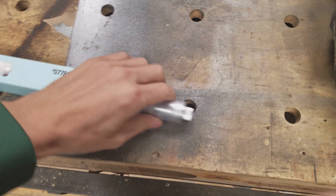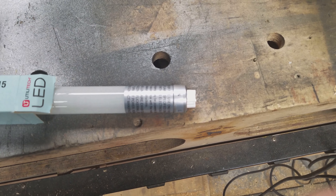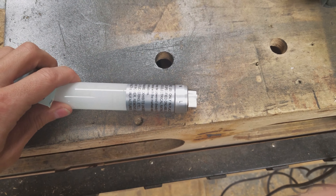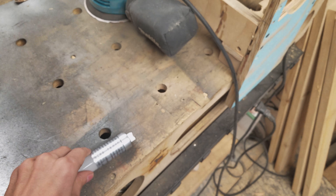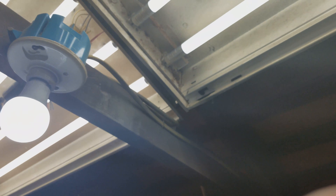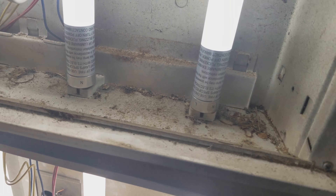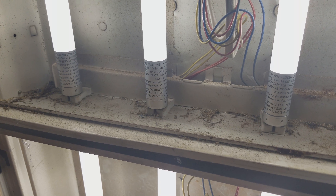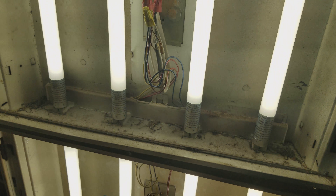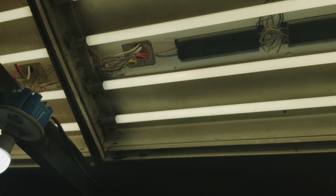When you pull the tube out on one end, you'll see an N and an L. Make sure that side is your neutral and your load or line — that's going to be the side that ties in to where the electric is. You can see they're all on that side where you're actually tying them in. Just make sure those letters — the incoming — are on the side with the power. The other side is just a holder, just holding the tube.